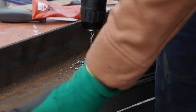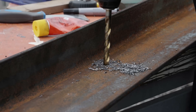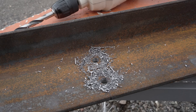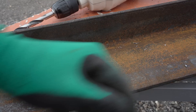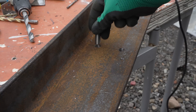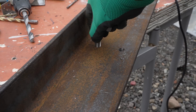After so much time trying to drill thick stainless steel, normal softer steel is something of a breeze, but you still can't go straight for the fat drill bit from the word go, as the tips of wide drill bits aren't designed to create a hole from scratch - they seem to prefer the easier, perhaps lazier act of widening a pilot hole. So: 6mm, then 10mm, then 12mm. It's perhaps unwise to anthropomorphise drill bits, but it does seem like a transfer of laborious effort from metal tool onto me.